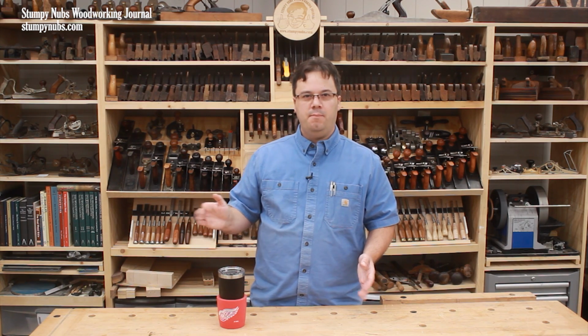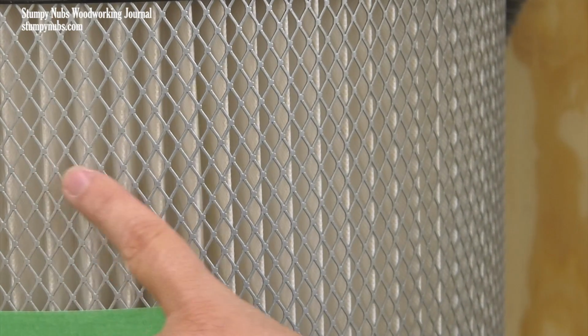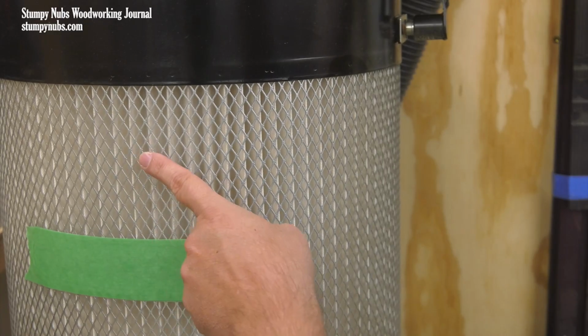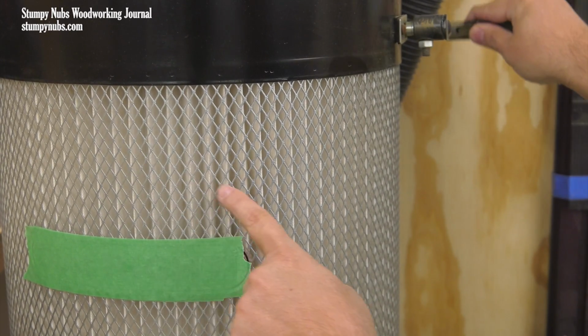This seems like a bad idea to me. Maybe I don't understand it properly and some filter company is going to comment here and fill me in, but it's going to be a hard sell because these paddle style beaters inside the filters seem to defy common sense. A pleated canister filter is made from paper. It's durable paper. Sometimes they call it synthetic fiber weave or something like that, but it's essentially paper. What do you think will happen if you aggressively rub something across these thin pleats on the inside?